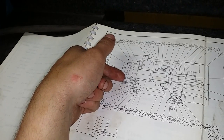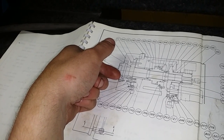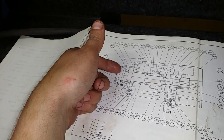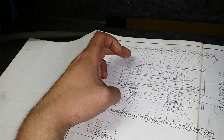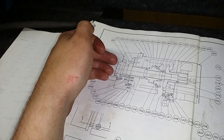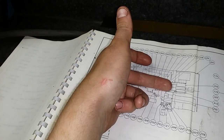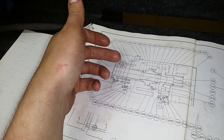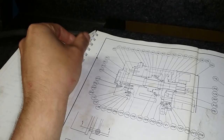So I think there were 6 bolts tightening the flange to the turret, so you have to loosen them all, actually take them all off. And then there were also 2 taper pins which you have to pull out. And then carefully, actually before you take off the bolts, switch off the controls, which also switches off the hydraulics, because otherwise this shaft will be pulled in, trying to tighten the turret like it should be. But when you have the hydraulics off, it shouldn't pull in, at least as much as when it's on.